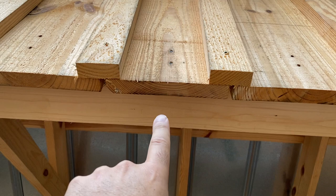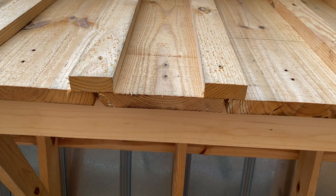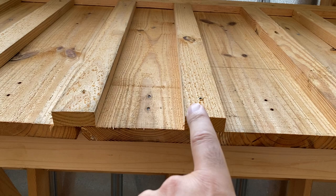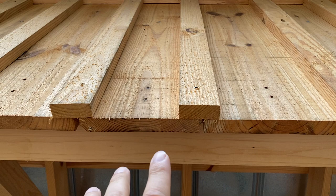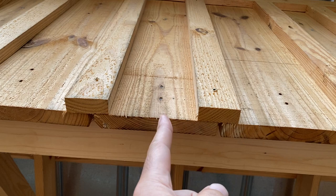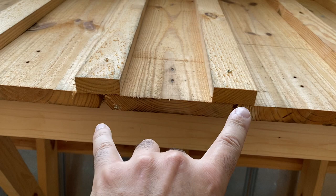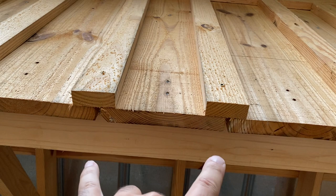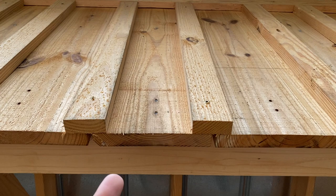One other important thing: when you put your siding board down, look at the grain rings — the growth rings on the end of the board — and flip that board so those rings are smiling to the outside of the building. That's really important. What that's going to do is, as the board dries and has a tendency to want to warp, cup, or crown, this orientation of the grain is going to cause it to crown outward. But because we nail it down the center, it won't be able to — we've held the center down to the framing — and as it tries to crown, instead of the center coming up it's actually going to push the edges in tighter against the building.